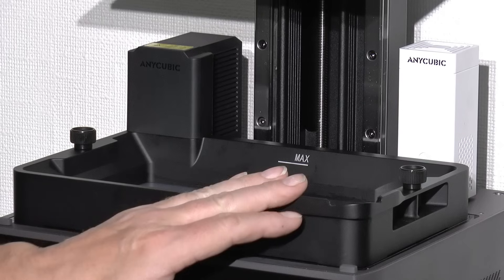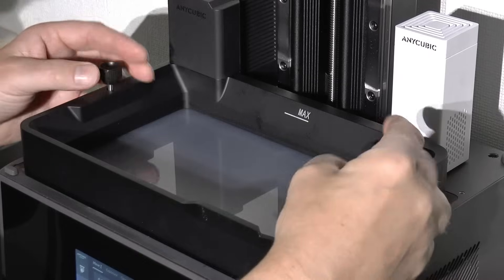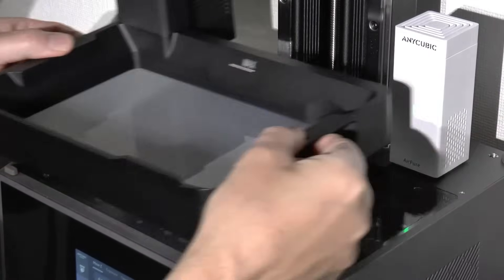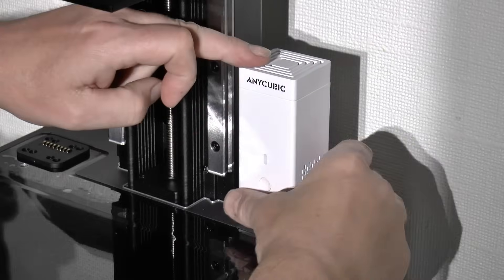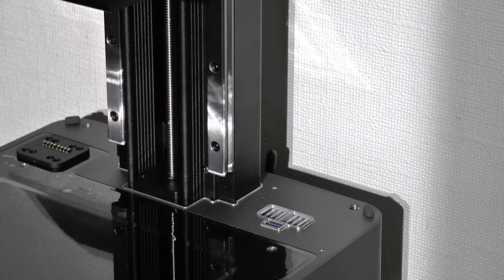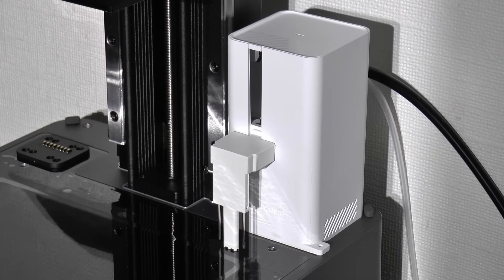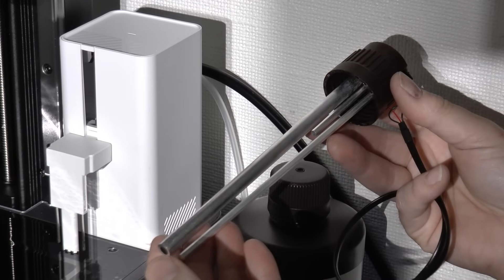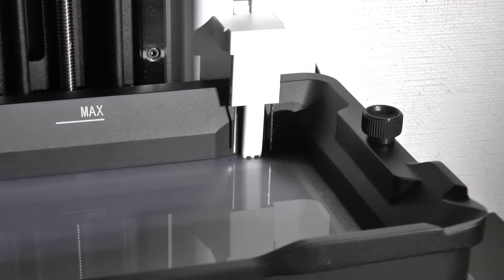The temperature display is connected to a heater which heats the resin vat frame, so the resin warms up and the printer lowers into the resin at the right temperature before printing starts — this vastly reduces print failures and increases detail level. Under the resin vat we find a 14K mono resolution display. To the right there is space for optional equipment — here is the air purifier I'm currently using, but you can also fit a resin pump which checks the resin level and fills the vat from a nearby bottle. The nozzle level check is motorized so it raises when you need to remove the vat.